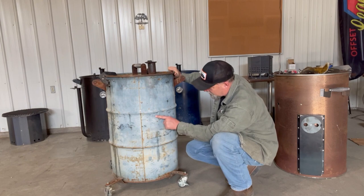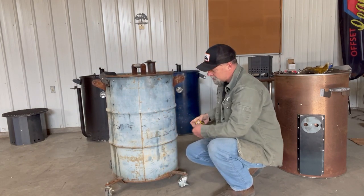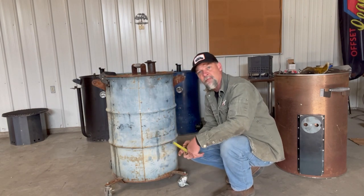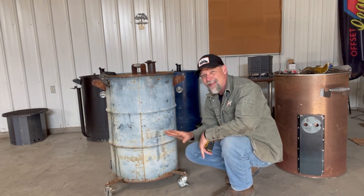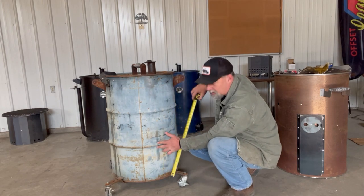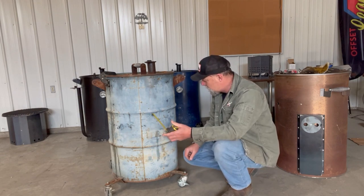Now the intakes are 20 inches tall. And from this here to the bottom of this top ring, we've got 22 inches. Now the one thing I'll tell you is that these ribs are not the same on every barrel. This is a very common design on this barrel, so I'm going to cope it to fit this rib right here.